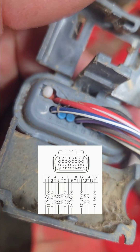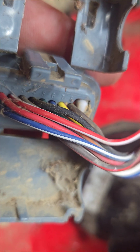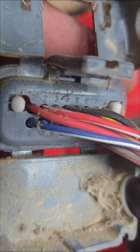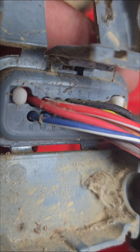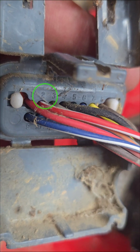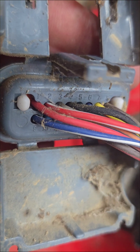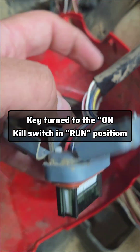And 9 through 16 on the bottom. You're going to check from pin 8 — make sure you've got ground on pin 8. Stick one probe there and one on the ground, make sure it tones out. Then put your ground probe back on pin 8 because you know it's good ground, and test voltage to pin 1. Pin 1 will have voltage whether the key is on or not, and pin 2 will have 12 volts when the key is on.